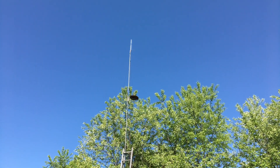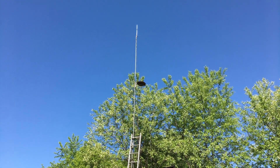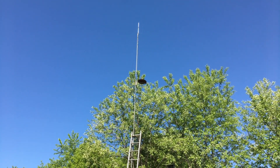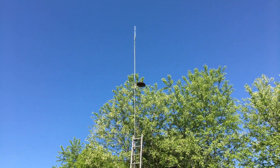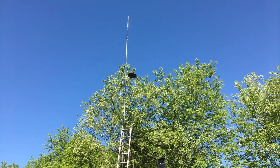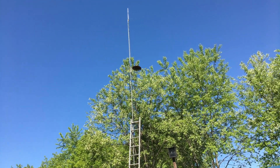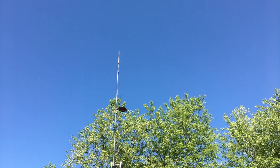This repeater setup is not in a very good location — it's in a valley, in a hole — which makes it great for testing repeaters and antennas. Obviously for any type of repeater, antenna height is king. The higher you go, no matter what brand-name repeater, the better off you're going to be. Let's go inside and show you the setup.